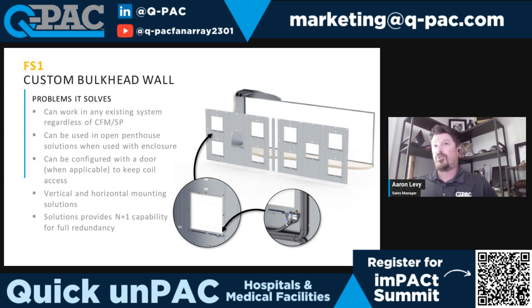In a lot of cases when you're opening up some of these air handlers, the double-inlet blower system has walking access to the coil side for cleaning or maintenance on the drain pans and things like that. By putting in one of these bulkhead walls you do sometimes lose some of that access. But if there's enough space to move the fans around inside the array, we can even add an access door, which eliminates that issue of getting to the coil.